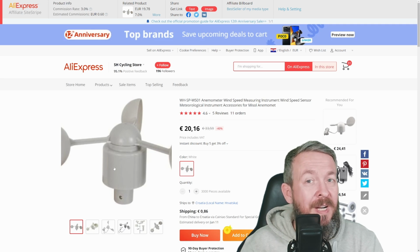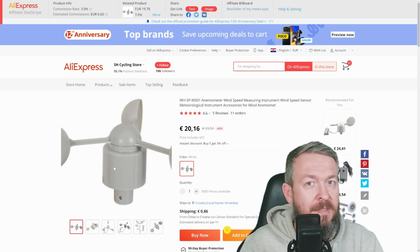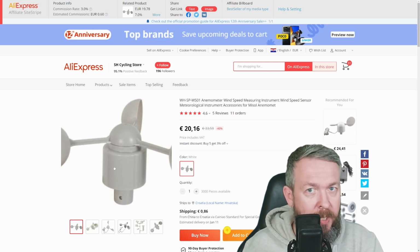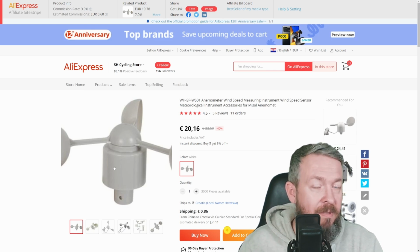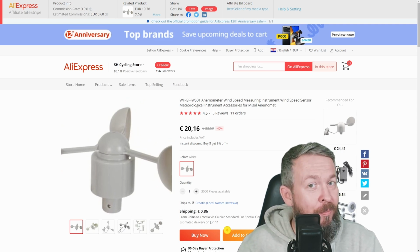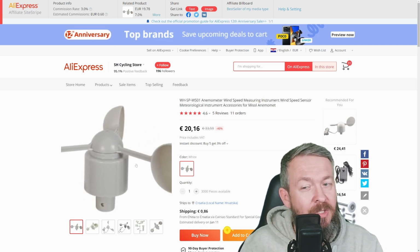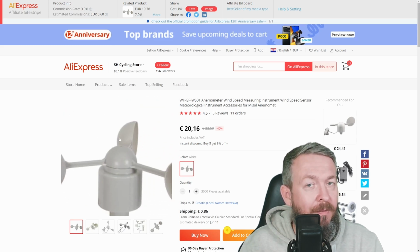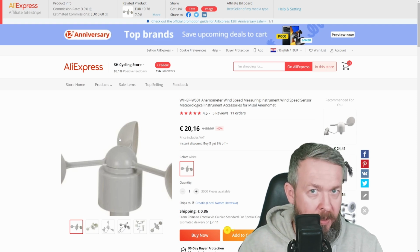we are trying to keep the device awake as small a window as we can, meaning detect, send values and go to sleep, because we are trying to prevent battery usage or make the battery-optimized version of the device. And rain is working similar to this one. Yeah, and the device has to be awake at the time of the measurement. So I'm still playing with that code, and so far I am able to detect wind, but if you have wind gusts, this device unfortunately is not able to detect them. It only detects the speed of the wind at the time the device is awake.